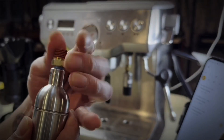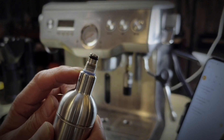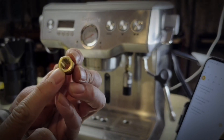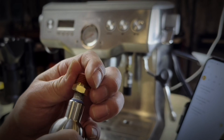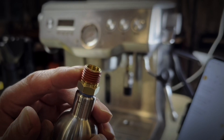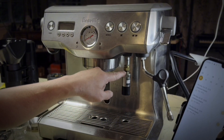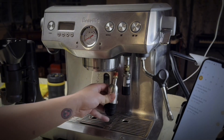You can see on here there's an adapter. I have an adapter because this is a 1/8 male — this is the European standard. This is the American NPT standard, also 1/8. This is a 1/4 male NPT fitting, and this Bluetooth pressure transducer also has a 1/4 NPT fitting. I needed this adapter to fit into here.